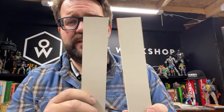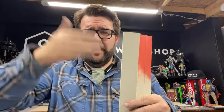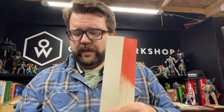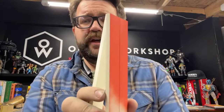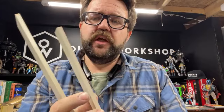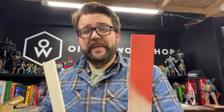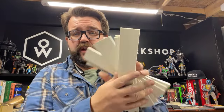So this is the same piece here. I just scored this side so it would look like sort of Quaker style vertical boards. So we're gonna score these and drag an awl through it. Well, it's a hole punch, but an awl through it to create a divoted ridged edge. And then I'll probably sand these edges a little bit. And then once it's glued down, I'll probably sand the whole thing, paint it and sand it again, and then see what I wanna do, if I like that look or not. But I'm just trying to think of ways with scraps and things I have around the shop, things that you can do too, to create visual interest in these interesting looking accent walls.